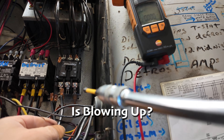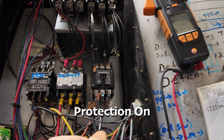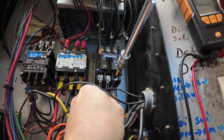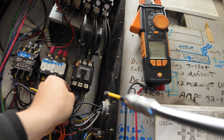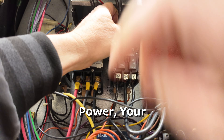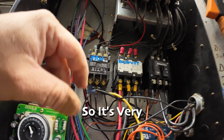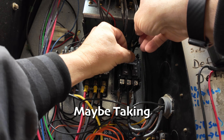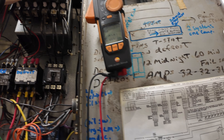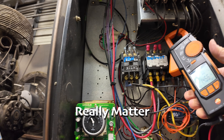I'm wondering if we're going to blow any of these other contactors too — very possible. There's no three-phase protection on this thing. What's going to happen when you lose one leg of power is the other leg can sometimes swing high — have a high leg. So it's very possible that's what took that coil out. That example happens more in single phase than three phase, but it could have happened here. I'm just speculating at this point. Phasing doesn't really matter with these kinds of compressors.